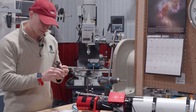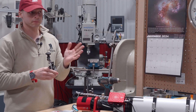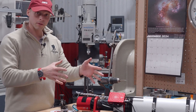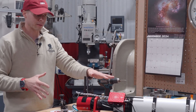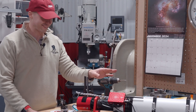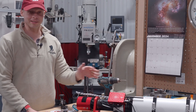This one also measures down to half a thousandth. You can actually look at the dials and say that's a couple of tenths this way, a couple of tenths that way. We're going to put some weights on the scope just to make sure it doesn't move. I've already got it sitting on my granite block here — about four inches thick, weighs about 800 pounds, takes four people to lift and move. We're going to use this as our foundation to do all of our tests.